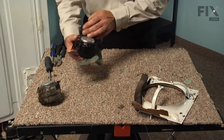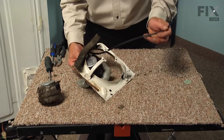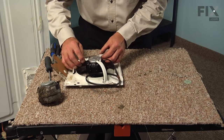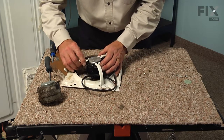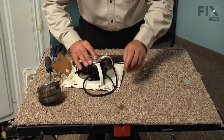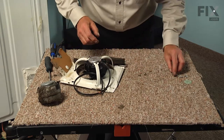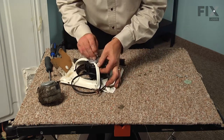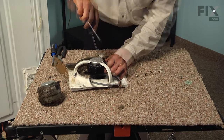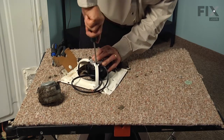Next, we'll mount that motor in the mounting bracket, so pull the wire harness through the opening, then we'll line that bracket and motor up so that the harness for the motor lines up where we took the mounting screw out of the bracket. We'll use the screws that were supplied with the kit and we'll tighten all three of those screws securely, making sure that the arms on that mounting bracket flatten out against the body of the motor.